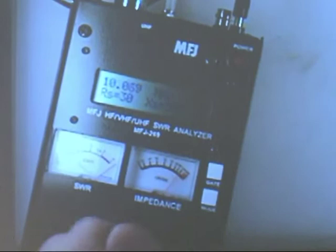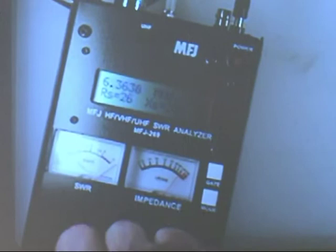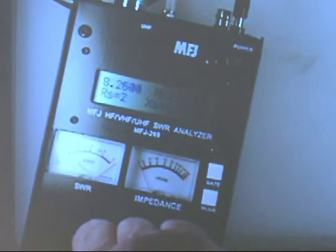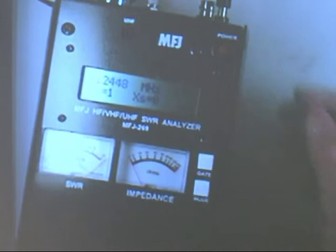Can y'all see it? Going to the next band, I'm going to start down. The easiest rough measurement would be right here on that meter, so I'm just going to sweep it up. There — so it's a short at that frequency: 8.2448.